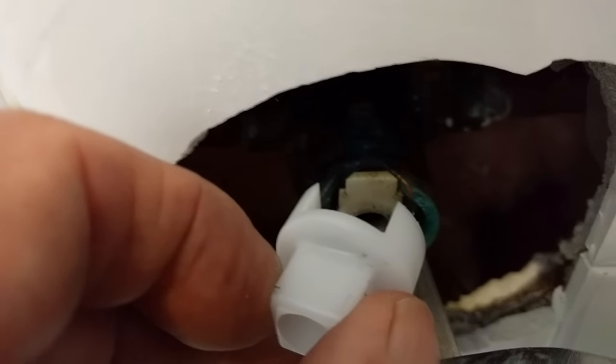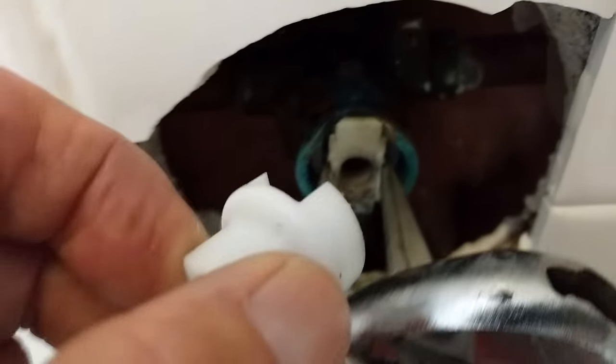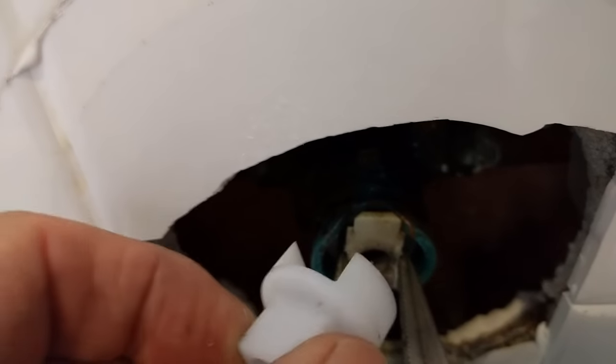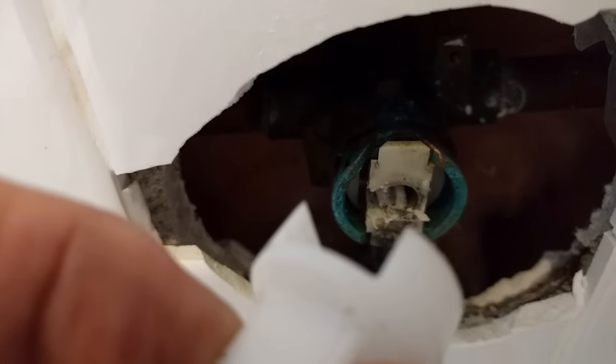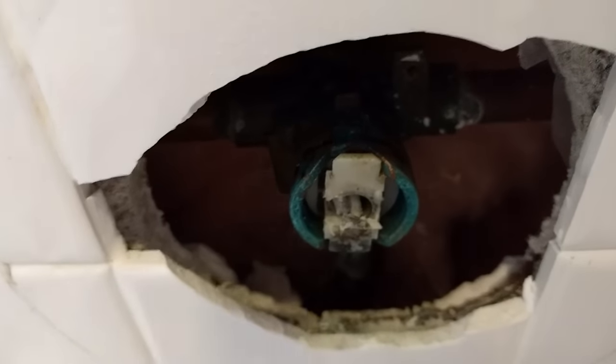So Froggy put his thinking hat on and here's what I came up with. These are vice grip type needle nose pliers — very small so they can get in there and grab that. And then on top of that, I put a crescent wrench so that I could have some leverage to move it left and right. What you want to do is put this on nice and tight, then twist and pull at the same time. Twisting, pulling — and that cartridge is working its way out right now. I need two hands to finish it off, but I wanted to show you the setup.